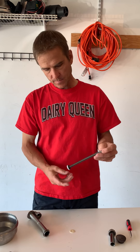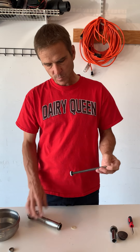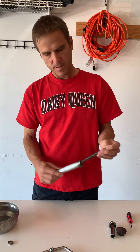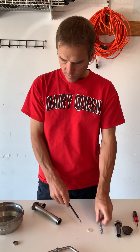I'll show you again. If you have it on here like this it'll just go down in and get stuck — did you see how that just happened? Now watch what happens when I put this little white thing on: as I push this down now it wants to come back up. I actually found one in a pump the other day where someone took it apart, lost this little washer piece or didn't know where it went, and just threw it away. That's one of the big problems.